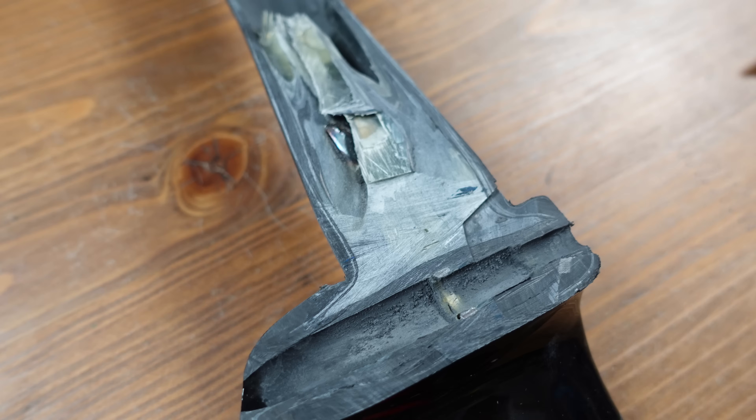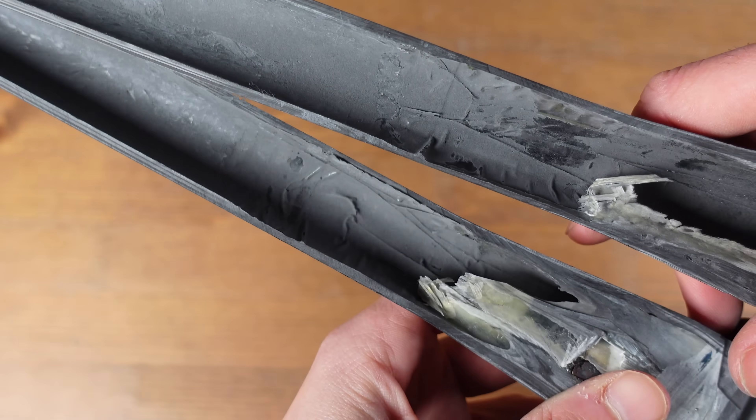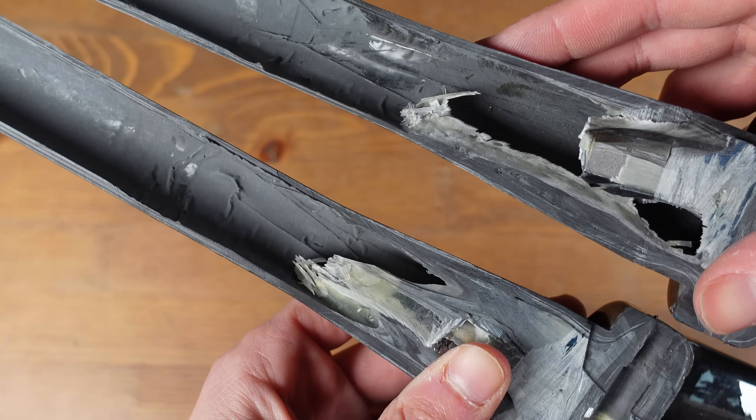So what does Rob think? I sent over all the pics and footage and he said it's looking as it should. He's surprised it's so untidy in the bottom half but not surprised about the wall thickness, which is a tad thicker on the crown race. The big difference being that the thinner side is on the rear of the crown race — whereas on the Trifox the thinner side is on the front of the crown race of the fork. Now if this video interests you, check out the next video where we cut up a high-end Canyon frame and took a peek inside — it's pretty insightful.